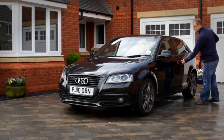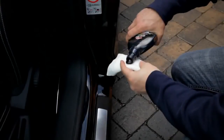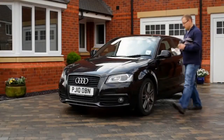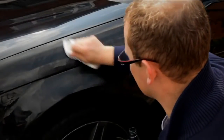Then remove excess wax with a soft, clean, lint-free cloth. Now you're ready to apply colour enhancing polish. Before use, give the bottle a good shake, then check the colour in an inconspicuous area — inside the door is good. Then apply the wax polish evenly to one panel at a time with a soft, clean, lint-free cloth using overlapping circular motions.